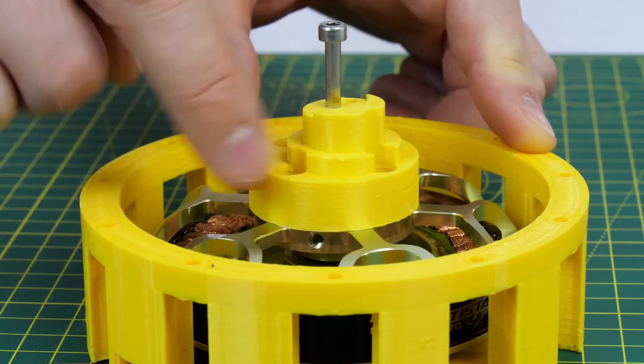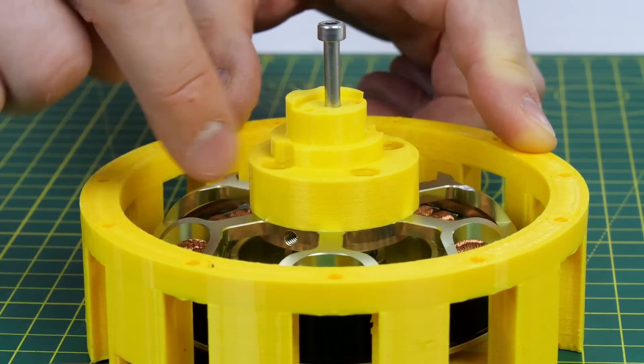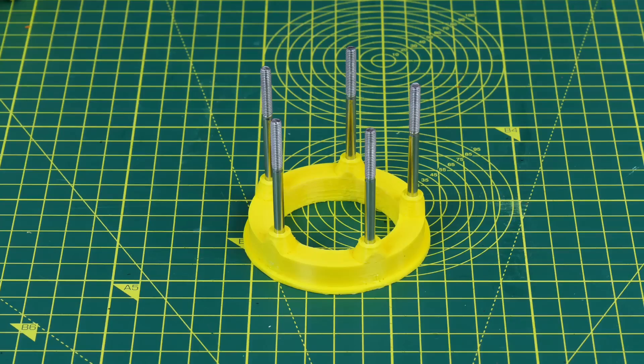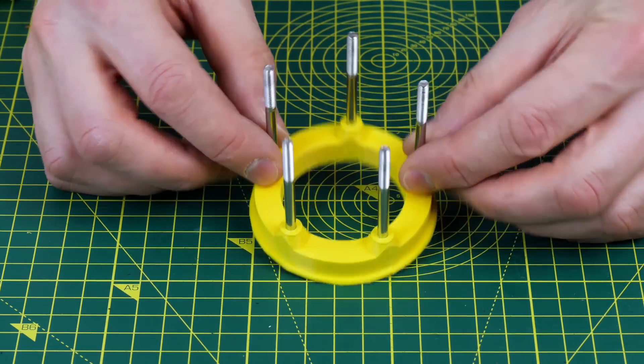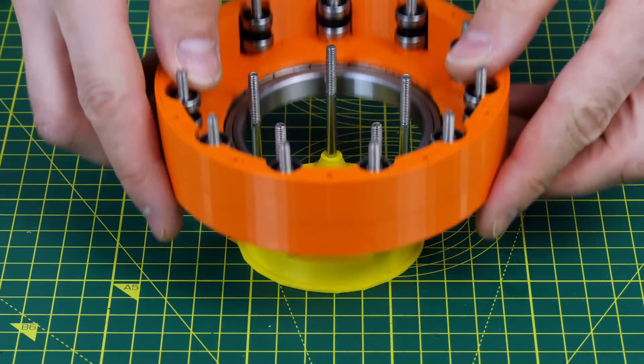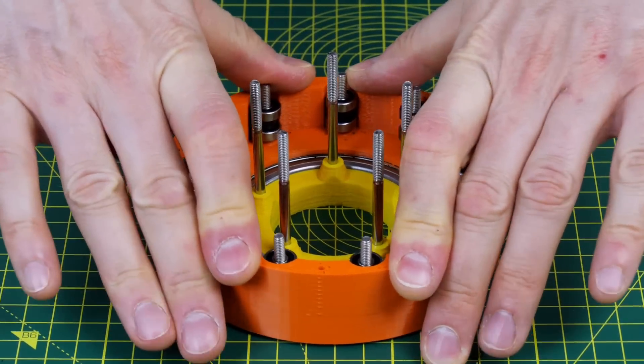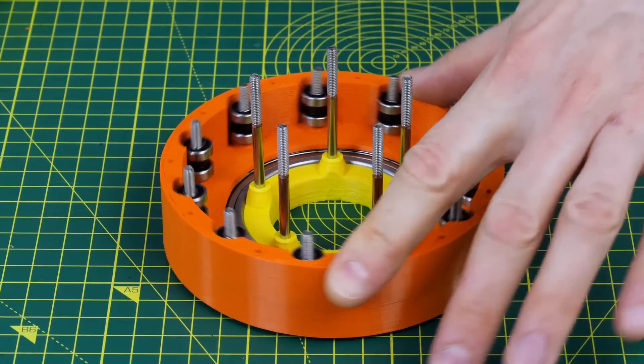It does have four bolts which will hold it on perfectly well. There's a bolt in the middle which should run perfectly on center, and the off-center cam you can see in the lower section which runs off-center to move the cycloidal disc. As before, I have five output pegs which will have bearings on to actually harness the output of the cycloidal discs. This time it fits on a larger bearing in the base, and there'll be a larger bearing in the top of the motor as well.